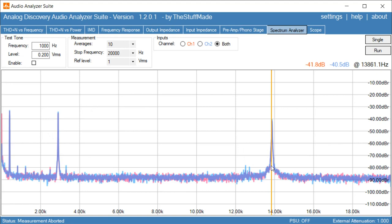So during the calibration, we can see in the display it was showing high and mid. So these are the two tones we have here. This is the high tone, this is the mid tone. So when we adjust the bias, we're trying to get these two tones to be at equal level. And then when we adjust the recording level, it is the low frequency tone here, the 400 hertz, getting that to the actual level. And then at the same time, try to get these two tones to the same level.